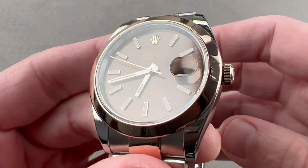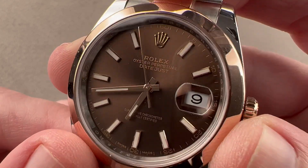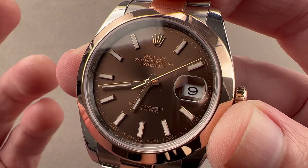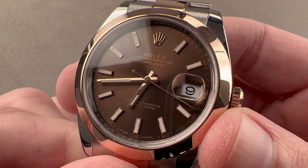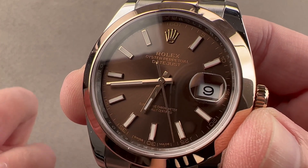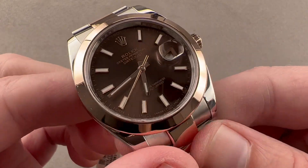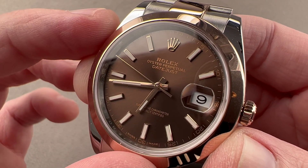Underneath the dial and underneath the solid case back, we have Rolex Caliber 3235, automatic winding with bi-directional winding action. Different from the 3135 in that it has a longer power reserve at 70 hours, and it also has a winding rotor on a ball bearing, which is more durable than the old jeweled staff. Pursuant to precision, we have a six-position adjustment. The movement is certified as a chronometer, but then it is timed to run no worse than minus two to plus two seconds per 24 hours as a fully assembled watch — hence the term superlative chronometer. The watch has a quick-set date and hacking seconds. It beats at eight beats per second and pivots on 31 jewels. It has a full balance bridge with a free-sprung balance that allows for very precise adjustment, and an overcoil hairspring with nicely centered mass. In any physical position, the watch will keep more consistent time than if it had an imbalanced flat hairspring, which by definition almost always has a large amount of asymmetrical mass — you have less of that with the centered mass of an overcoil.